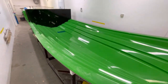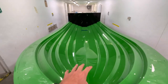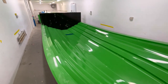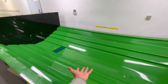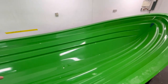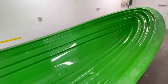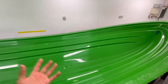Here we have a hull mold, and this is the first stage of building any Ribeye Prime or any Ribeye Yacht Tender. The first thing the guys do is polish and wax the mold so you can actually get the product out once the hull is made. You'll see all Ribeye hulls have a lot of chines, a lot of spray rails, a nice deep V and a high bow — that's why our boats are known for being the best, driest and softest sea boats. Next we need to choose your gel color.